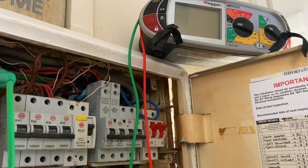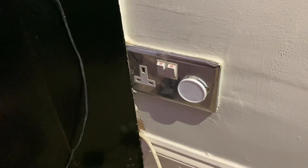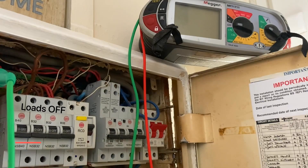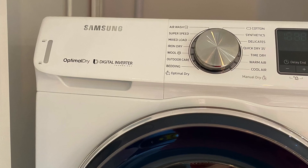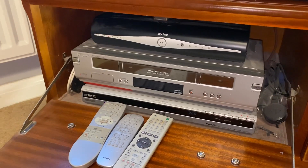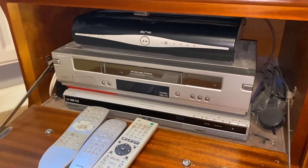We're going to do the test at the RCD itself, as manufacturers specify — you should do it at the RCD with no loads. With the ramp test, you don't really want loads on anyway, because we need to find out what the RCD is actually tripping at in terms of how much current it's going to take to disconnect this RCD, without any electronic devices in circuit which may be giving natural earth leakage.